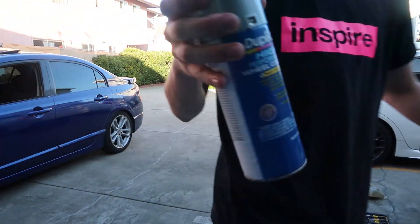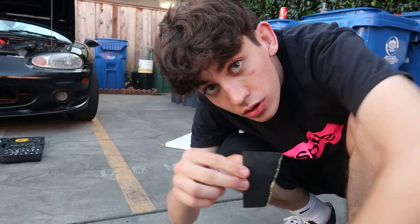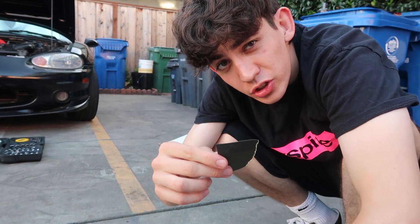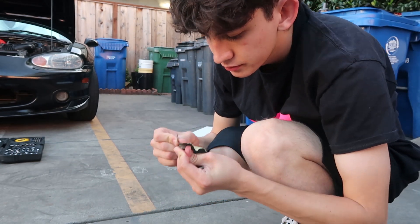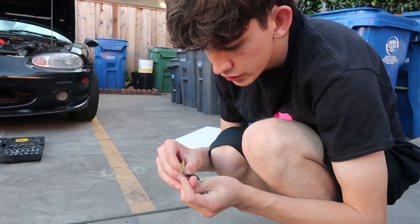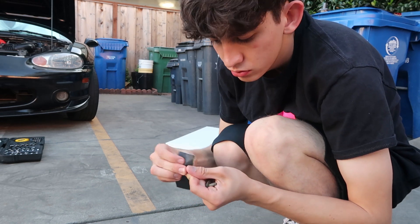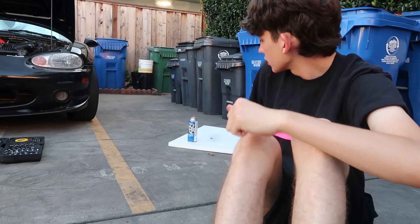This cap has some weight to it — we don't use that foo-foo lame stuff out here. If you do care about your bolts, rough them up with some sandpaper — I'm using 300 grit, just rough it up a little bit. Painting them prevents rust in the future. As soon as you finish roughing up the bolts, they're ready to be sprayed down.